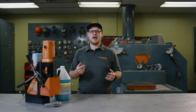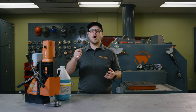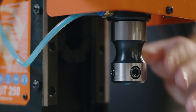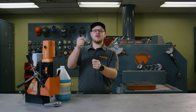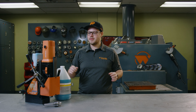If you're having trouble getting that switch fully up or fully down, sometimes the gears on the drill are just like a car — it's like a clutch system. What we have to do is while pushing the switch up or down, we also have to hold the spindle and rotate it slowly back and forth — a technical term would be jiggling — to make sure we can fully push it up or down, and then we'll be able to start the drill properly, obviously when everybody's hands are away from the unit. It's as simple as that. Thanks for watching.